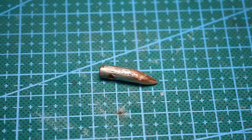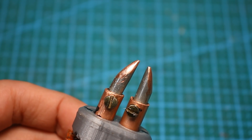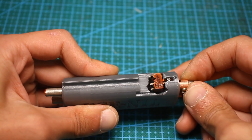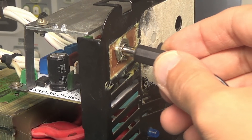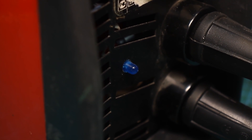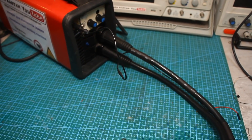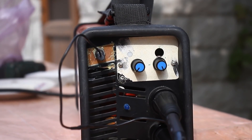In the case of using more flexible wires, their length can be reduced, thereby reducing losses and increasing the maximum welding current. The electrodes are made from the same copper rods — bent at a slight angle with pointed tips. The button is connected through a connector installed on the front panel; if desired, you can connect a foot pedal there. Also on the front panel, an indication LED is installed. Upon completion of all work, the device must be adjusted — specifically, we need to make a power or current scale, as well as a timer scale.